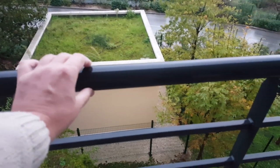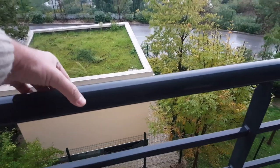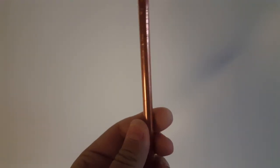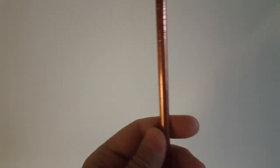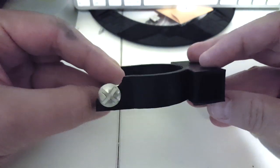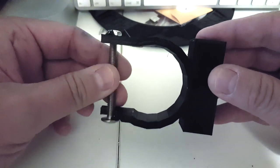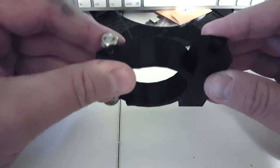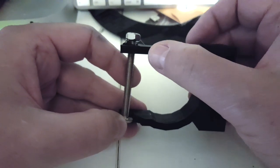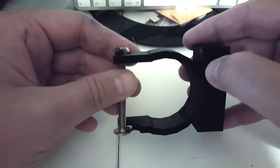What you see here is a round tube, about 50 millimeters in diameter, so I needed to make a clamp that would go on here with the antenna pointing up. I got an 8 millimeter copper tube — it's fairly thin, but it's not a very long antenna so that won't be a problem. Here is the first clamp I made. You can see it's broken, but it's not a problem — I made a big mistake. The holes on the tabs are too close to the tube, and it actually interferes when the tube is inside: it touches the bolt, so I had to redo it.